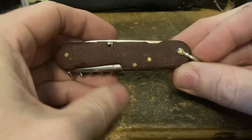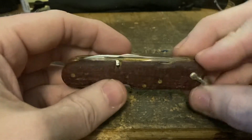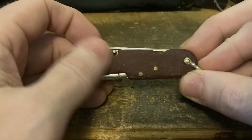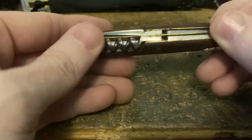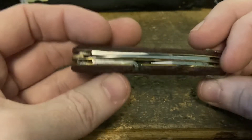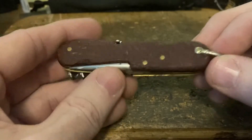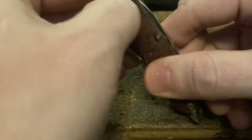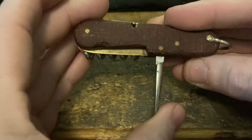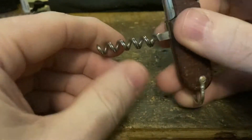Next up is my heavily rebuilt 1923-ish Officer's Knife, 84 millimeter standard — at the time I believe a number 205K. This one came to me with the scales in terrible shape, falling apart. I cleaned it up as best I could; the liners had a crack but I wanted to keep the original parts. I did have to replace the spring for the opening tools. First up, we've got the awl — love the awl — and those beautiful brass liners shining, with the five-turn fluted corkscrew.